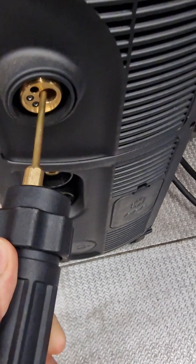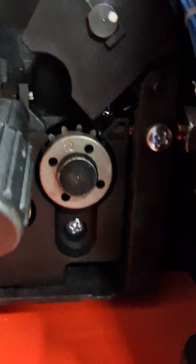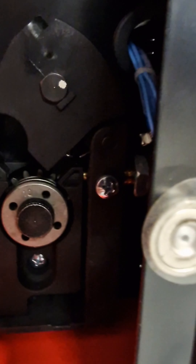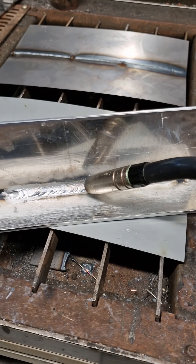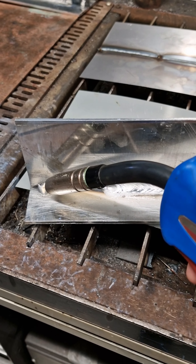You insert and fix the torch. You have to see the liner almost reaching the rolls here. Go forward — you proceed like this. This is the direction of the welding with Aluminium.